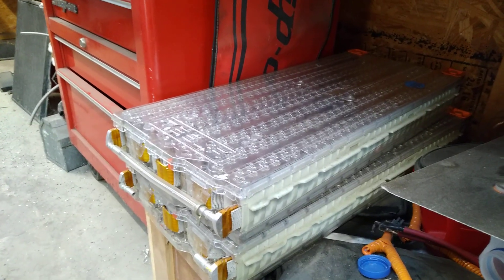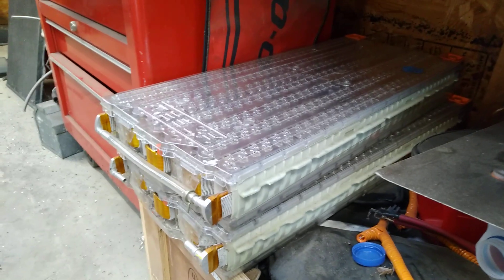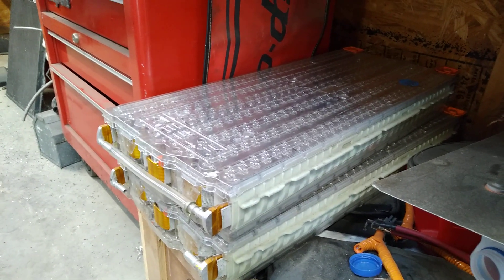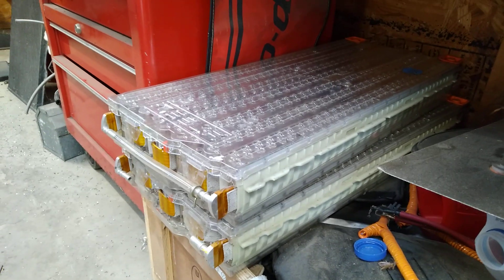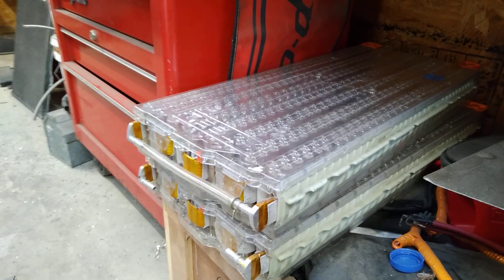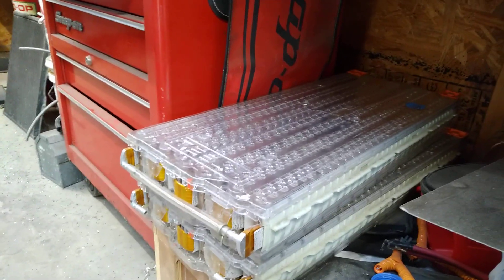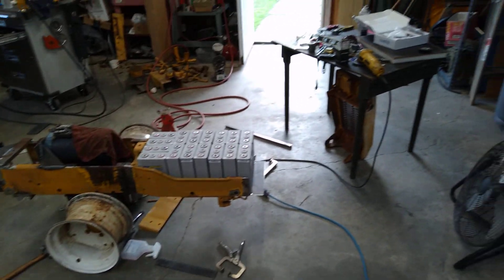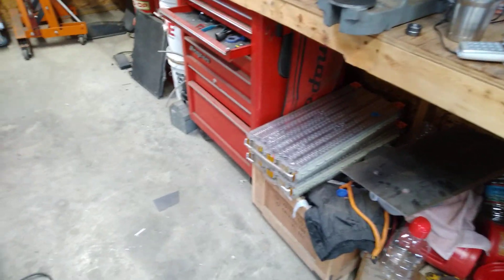We're talking the same energy as the lead acid and the lithium iron phosphate — lithium iron phosphate weighed 120 pounds, these weigh 52 pounds — so it's half the weight. You'd need two of these to make a nominally 48-volt pack, and when you put two together you have 11.5 kilowatt hours, which is twice what I have in the lithium iron phosphate. So this is 100 pounds with twice as much energy as lithium iron phosphate. And our lithium iron phosphate has as much energy as lead acid at a sixth of the weight. That's the generation of batteries where we're at, and newer ones will have more energy density.